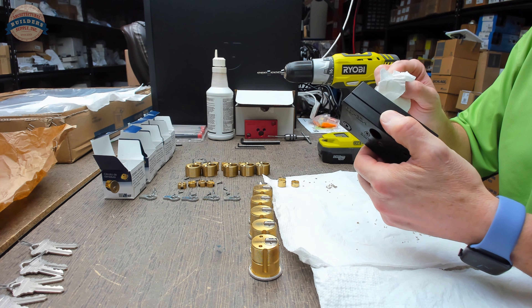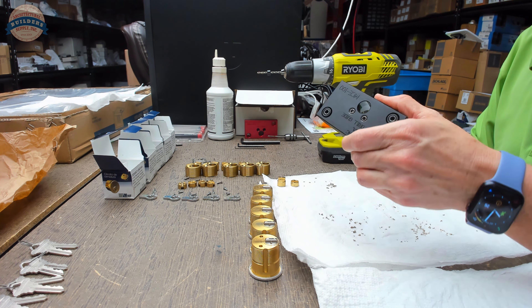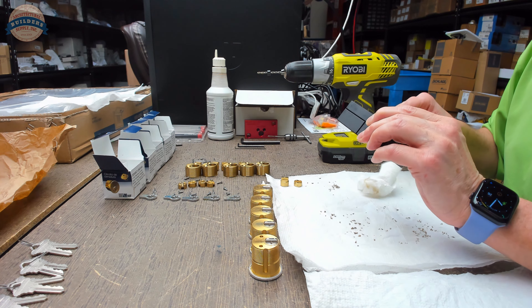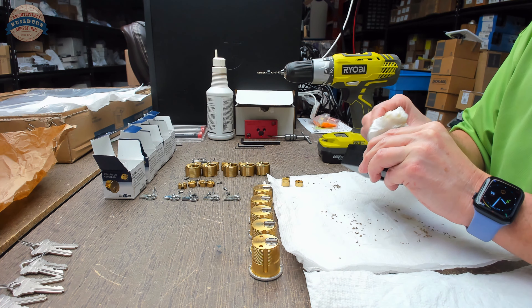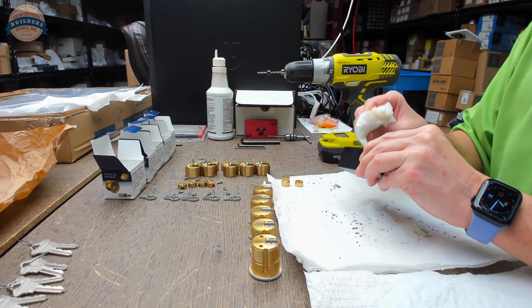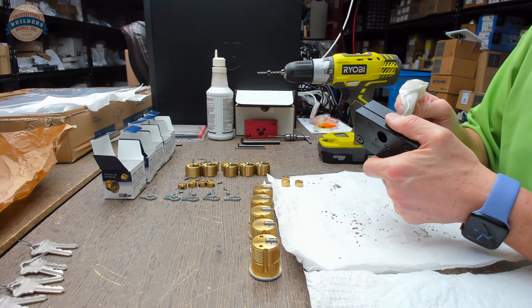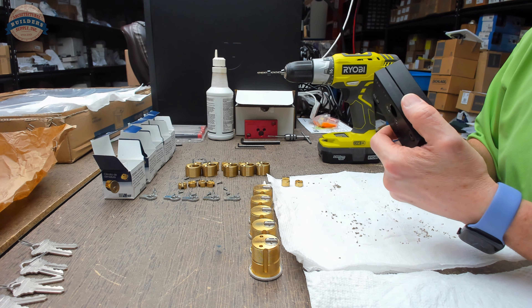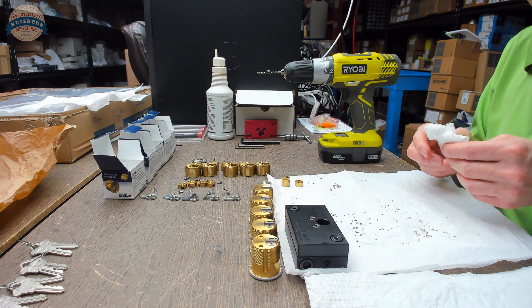As my skills grew and I dealt with customers that required a different perspective on what was being sold — I wasn't here anymore just to get your money and load you up with 18-gauge 3'0" doors for that strip mall. I wanted to see the plans and specs. Those would call for D-series doors, unusual hinge preps, unusual gauges and types of construction, advanced hardware preparations. So learning to navigate the manual and wield it correctly became required.